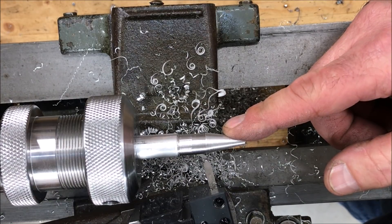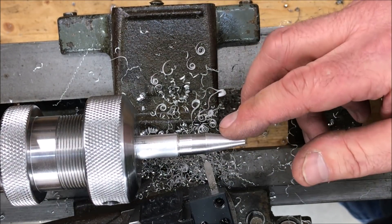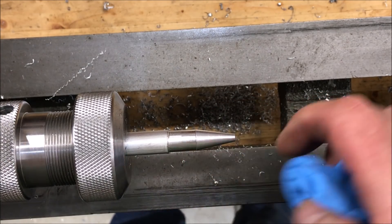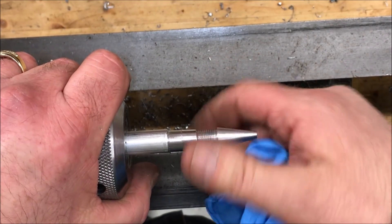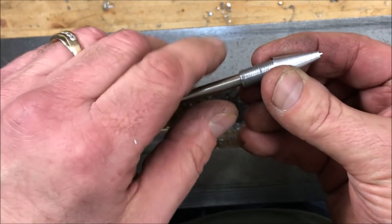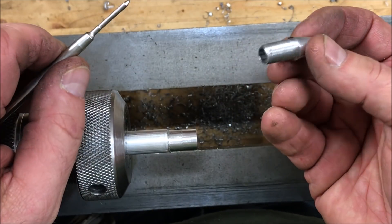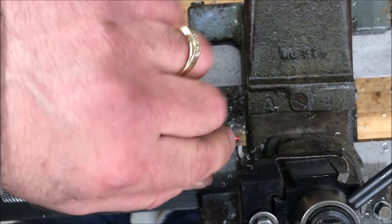This nib is purposely longer than it needs to be for the ink refill, so we're going to remove it from the mandrel, get a good measurement, take off the section we don't need at the end of the nib, and then finish tapering to its final shape. When the nib gets tight against the mandrel — remember we put that relief in there — I like to use a neoprene glove to get a grip on the nib and remove it from the mandrel. I'll insert the ink refill to check the measurement — it looks like we need to take off about an eighth of an inch. I've made a little red mark on the end of the blank to denote how much I want to remove, and we're just going to take off a little bit at a time until that red mark disappears.